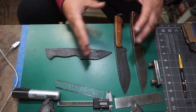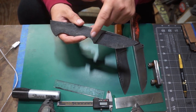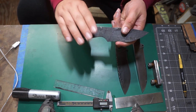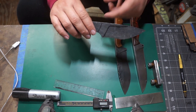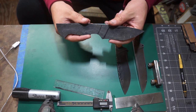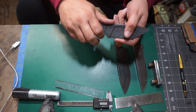I've got a few reference things here that I'm going to talk about, but we're going to start off with the handle because I'm primarily focused on this area. You'll see I already have some lines drawn on here. When it comes to deciding how I'm going to design my handle and where it's going to end, I'll get into more depth when we get to the handle-making process — but this line plays a pretty important role in the ricasso size, the plunge line design, and a lot of different things I design the blade with. For this knife I wanted a handle that fit my hand all the way, so my finger comes all the way up to the finger choil area right where the handle starts.